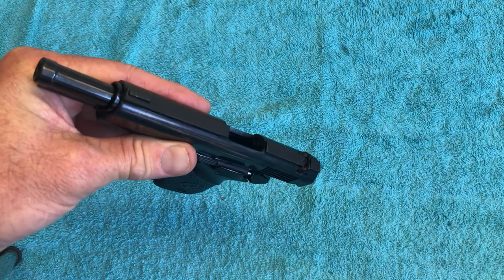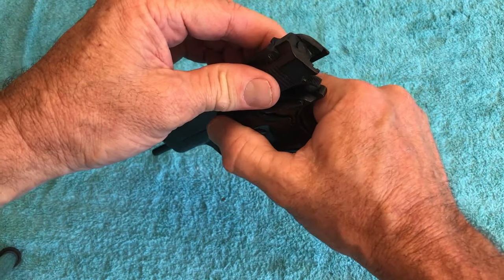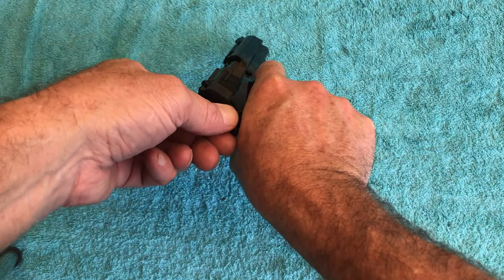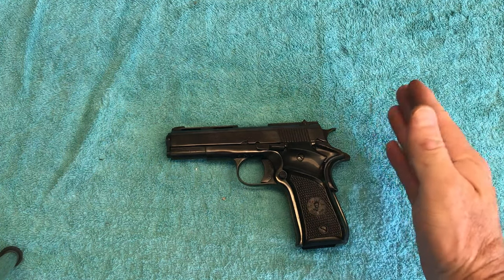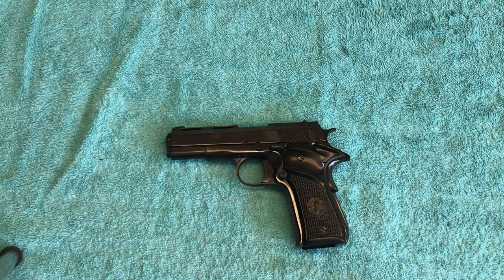I don't think it's the length of the firing pin or anything. Grip safety — I don't think the firing pin length is wrong. I believe it's the spring. I'll buy a new firing pin spring for it. Should be about a 38-cent part, but it'll be like $5 with $75 shipping and handling. I'll get that spring and try it out, and I'm going to try to film it in slow motion just to double check and make sure the hammer's not falling when I release the slide. I'll keep you updated.